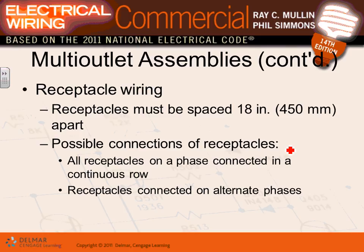For multi-outlet assemblies, guys, they said when they space the receptacles, and again, it depends if you're building it in the field. If you're building in the field like this, can you guys see that? 18 inches between the receptacles, but they can also be listed. You can list them at less than that. Look at the one in front of you here. This is listed for less than that. But typically, receptacles must be spaced 18 inches apart,